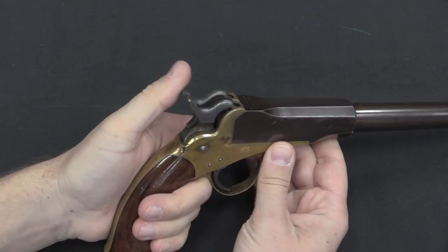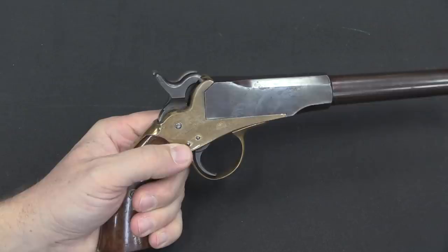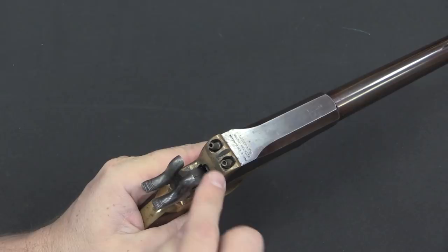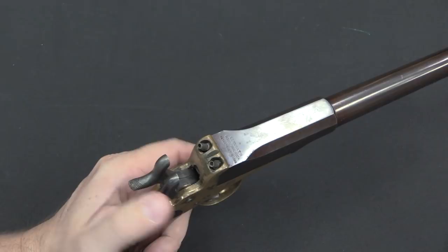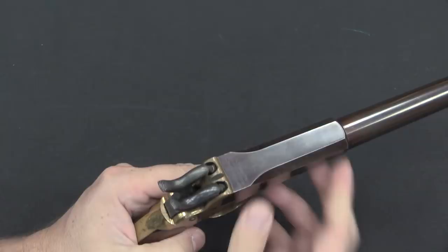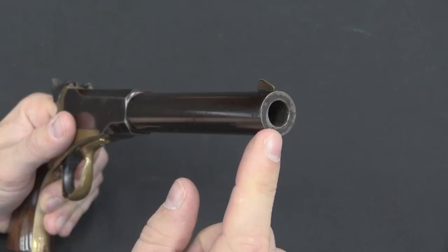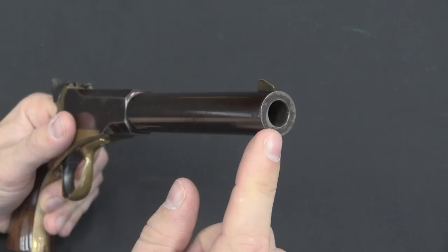There are a number of ways using this pistol can go quite badly for you. For example, if in combat you lose the percussion cap on the right chamber and pull the trigger, nothing will happen. The trigger then has a quite light reset and re-pull for the left — and if you do that, you're going to fire the rear charge in front of what is basically an obstructed barrel. The barrel wall on this thing is remarkably thick, much thicker than I would expect necessary for a .45 calibre black powder handgun. That makes me wonder if Lindsay was deliberately making it strong enough to withstand firing a double charge if done unintentionally.